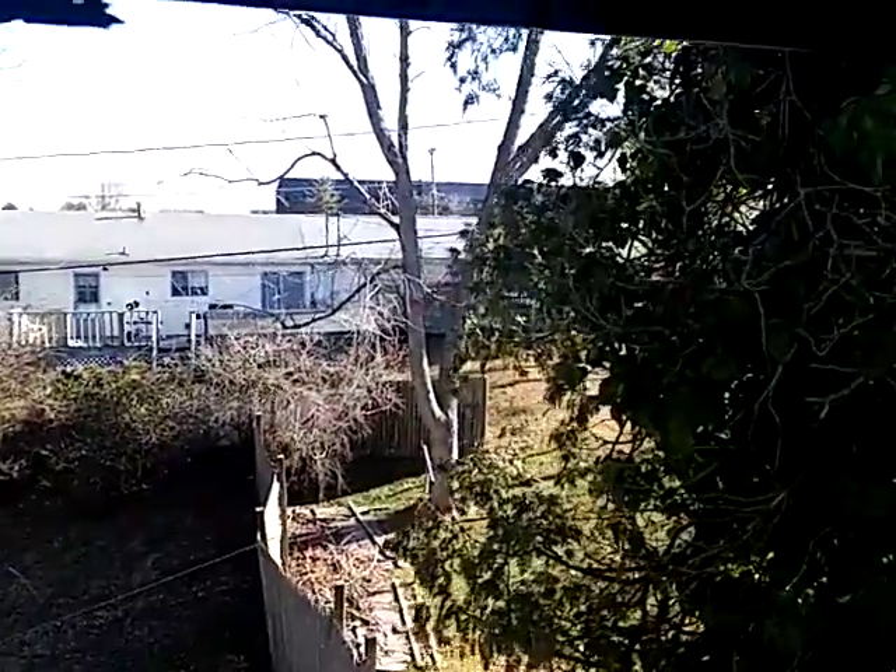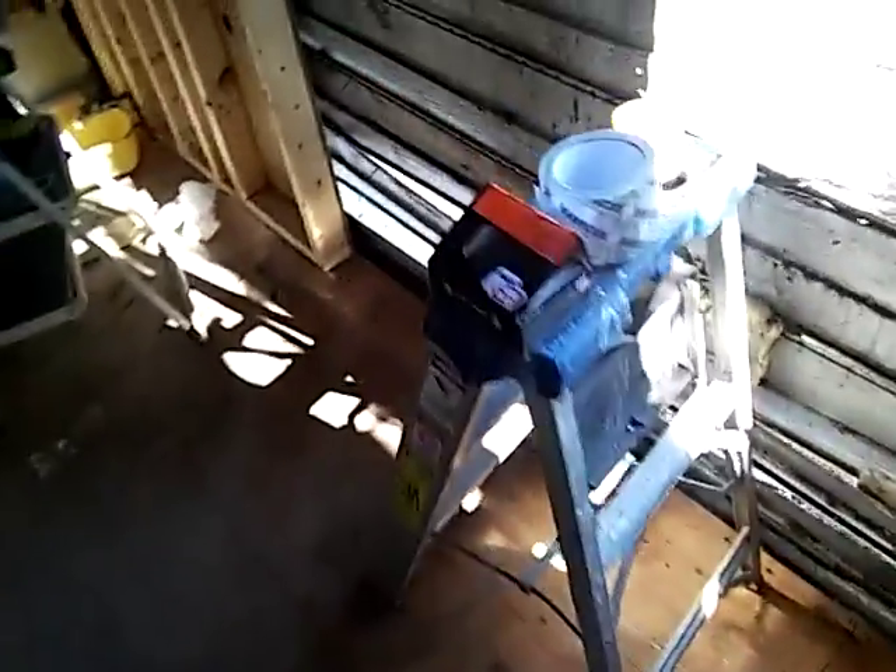The wall is going to go right here. Now, they had this siding much bigger — the window was bigger than they had previously, I guess, up here. That's why you had the opening. And so, a little insight for the owner: you have to get your roof done. This is rot all the way across your edge. I'm going to take this wood right here out so I can put the wall up. But, as you can see, all this wood back here is rotted, so the roof had to be redone.